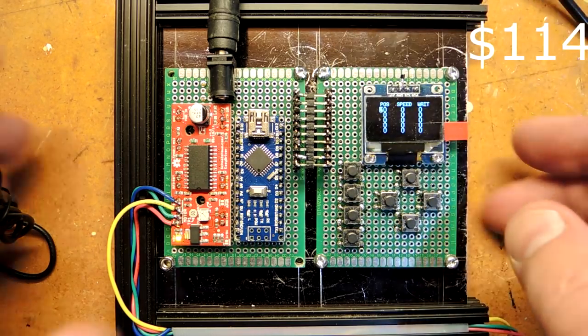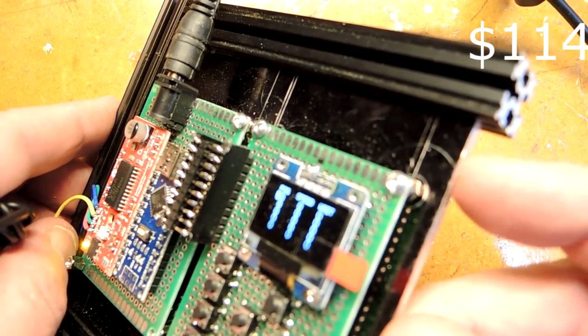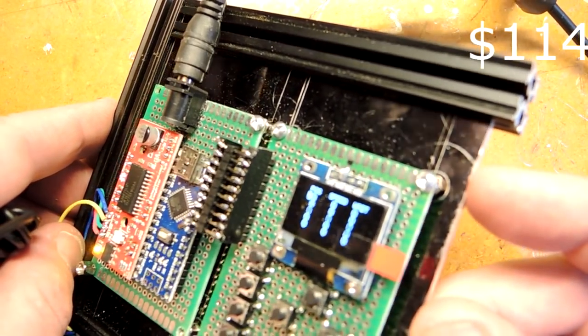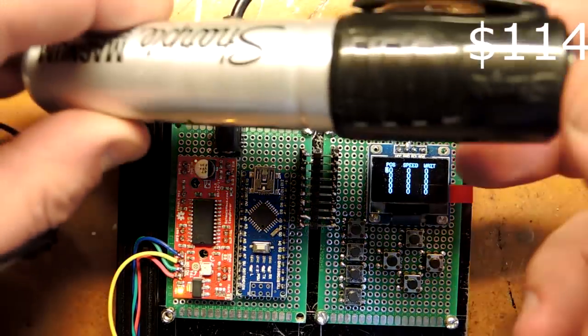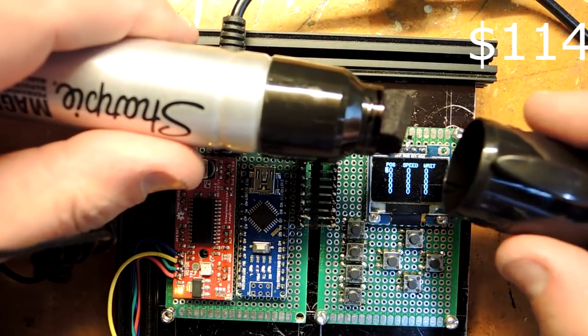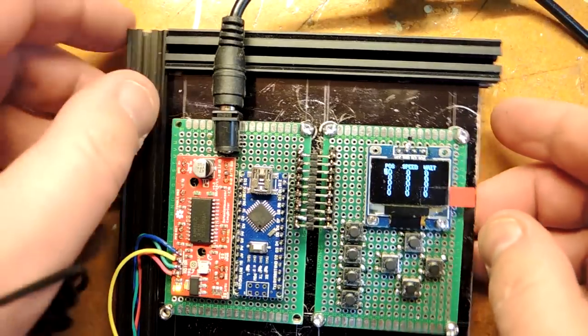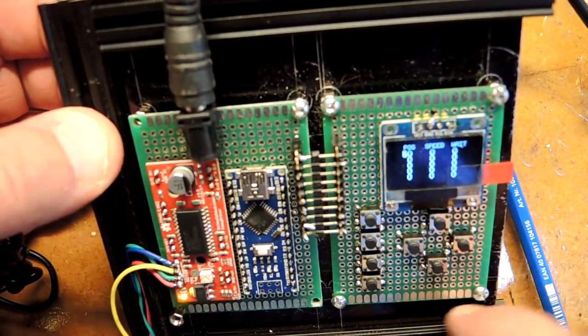This platform is of course sheet metal. The nice thing about the open beam system is that you can slide in an eighth-inch piece of metal quite easily. The reason it's black is that when I did the layout for it I didn't use the blue dye — I used a gigantic Sharpie instead. It's another technique for marking up metal, and I needed to place very precise standoffs to mount the electronics.